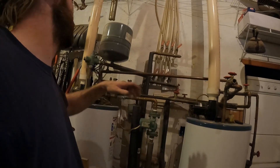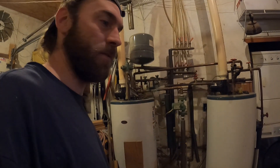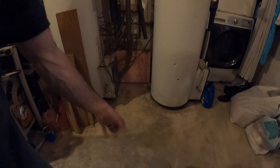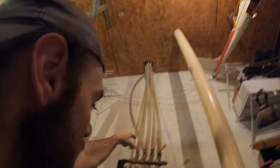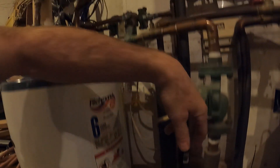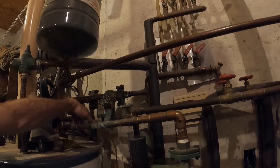It does work as long as you keep an eye on it. I've never run it dry. If it starts to feel like you're not getting much heat, you probably need more water because you're cooling off that giant block of water. Speaking of a giant block — this concrete floor is one giant block; it acts as a huge radiator. The water flows through up to the system to go upstairs, and then it comes down to a whole set down here, runs down through the floor and back up through the circulator.